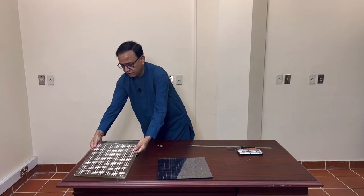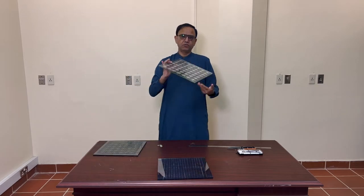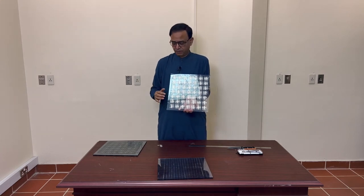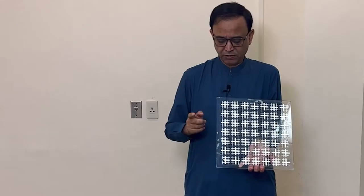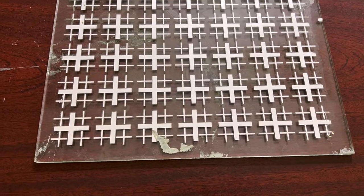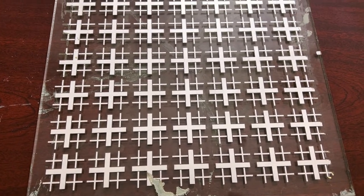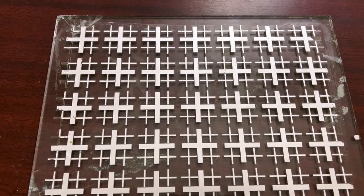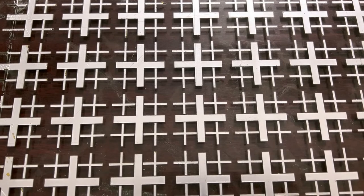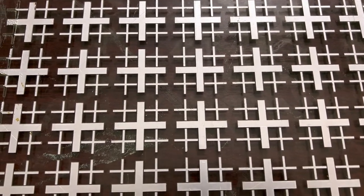We found another solution just to see whether we could get a result. We created a complementary structure on an ordinary glass — this ordinary glass has no coating. We pasted an aluminum sheet on top of it and then used a milling machine to etch it. This is not an aperture type FSS; it's a metal type — like a band stop filter.